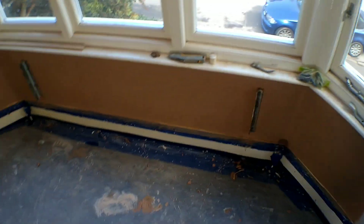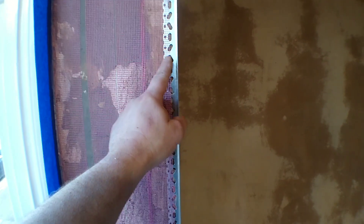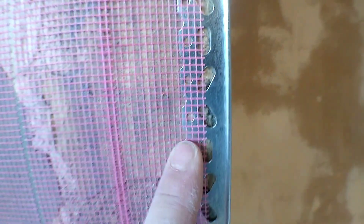All this has been primed and meshed all round here. We took the radiator off for the customer, and again fiberglass mesh all the way round. There's some scrim tape here on the bead — we always scrim all the beads as well. Now and again, depending on how much movement you get, sometimes you'll get a slight hairline crack down the wing of the bead, which is why we scrim the bead too.